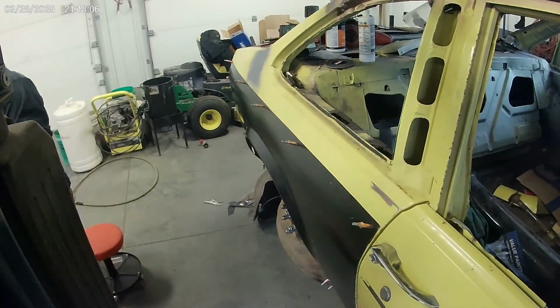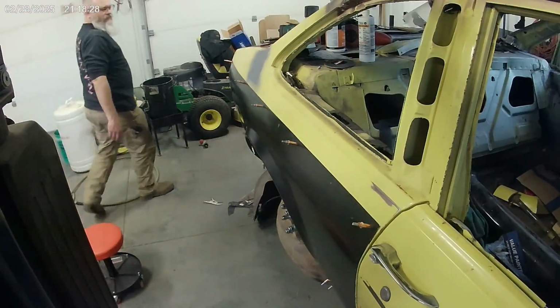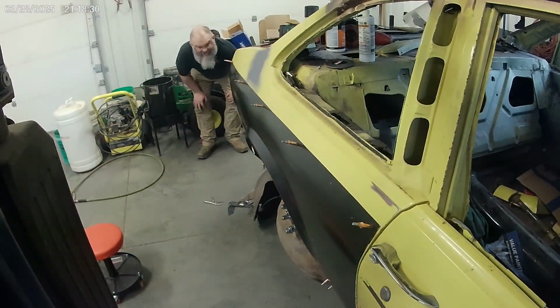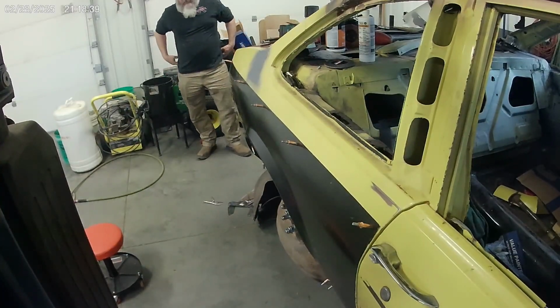Yep. Ultimately, the rocker decides it in the front. That looks a lot better. That stuff at the back is why I don't want to rebuild that yet, because I'd like to have that trunk drop off and that wheelhouse completely done before we build that piece, so that the quarter goes right back where it's supposed to. But now it looks right. Yeah. You know what I'm saying? Now it looks right. Yeah, it looks better. And just having this clamp here to hold it there gives it where it needs to be. You probably need to drill, put a Cleco back there.